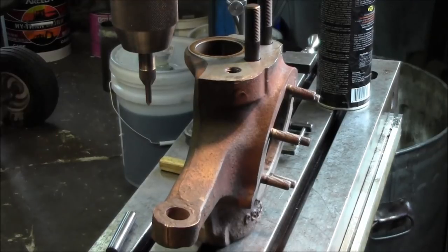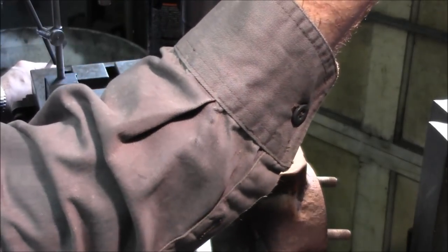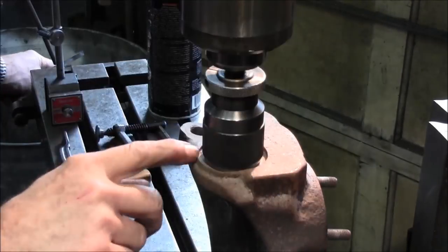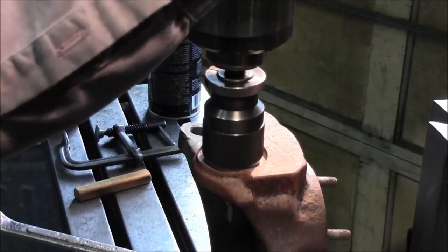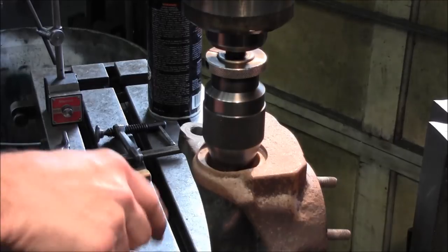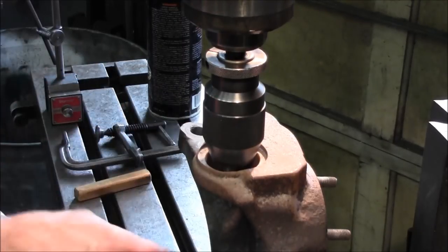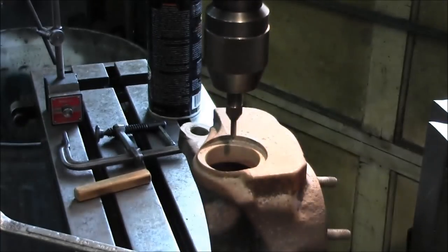All right, so we're going to unbolt that one and put in our other one and start dialing it in. Before we get in here dialing, let's rough this out. Let's get the drill. This taper kind of comes down into that bore, and I can just eyeball the gap in it here. We're like 48 thousandths, but that could be the play in this unit down here compared to where the other one was in relationship to the T-nut slot here. All right, so we're going to call that 0. And we're going to call that one there 0.